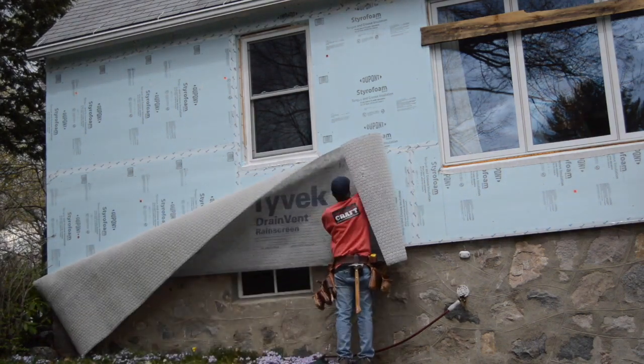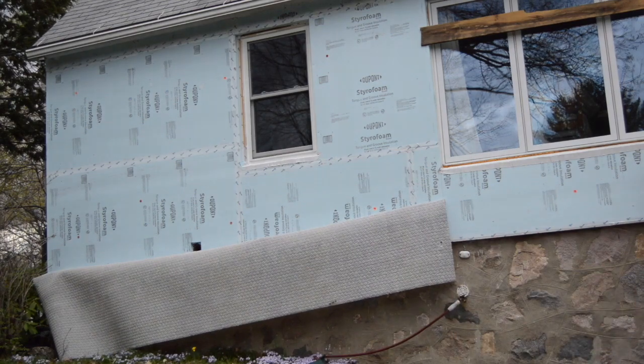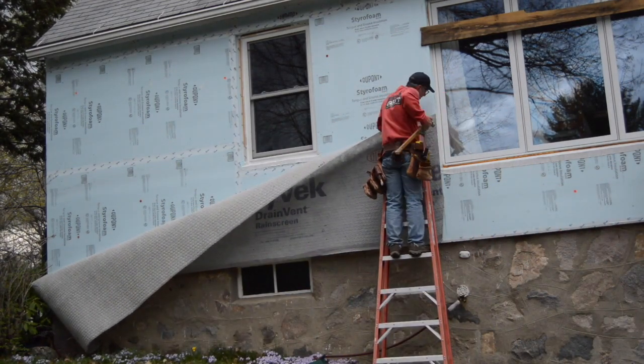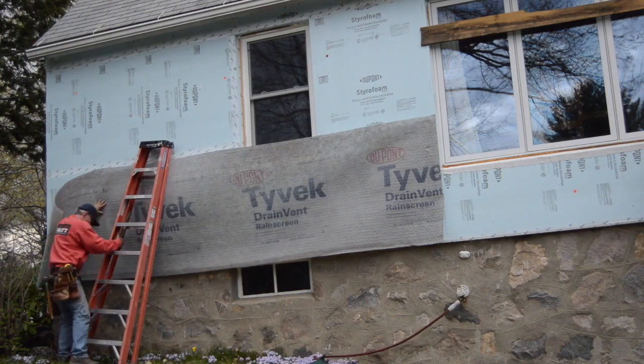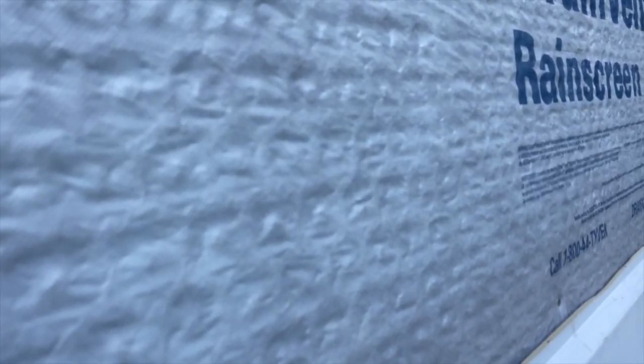With this sheet product, I tack the corners until I have the whole piece where I want, and then I add additional fasteners. Also like the Tyvek, I align the bottom of the sheet to exactly where I want, and then I smooth the rest tight. The outer fabric-y layer is a protection against stucco or mortar from getting into the mesh — it's not a water barrier or an air barrier because all that stuff is already detailed.